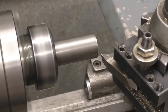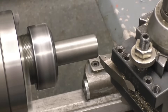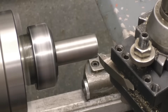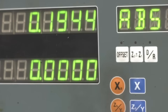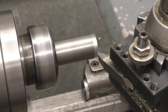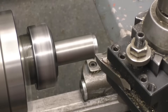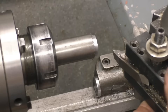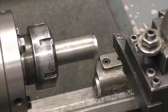Right, I'm going to use the DRO because it's there. We'll touch it off and zero the DRO, put in some cut — it depends what you're making how much cut you're going to put on — and then we'll take that in. Once we're approaching the 200 thou, start just short of the 200 thou and take another cut. This is not nice material at all, it doesn't like it, so I'll put a different tool in.